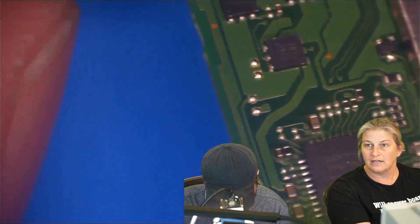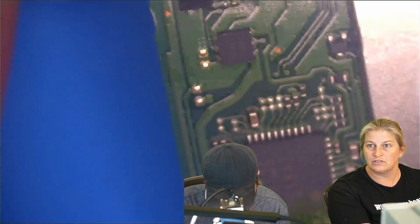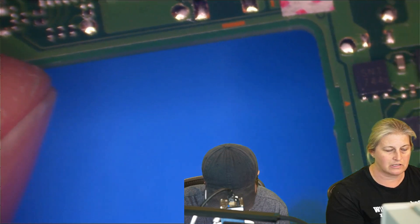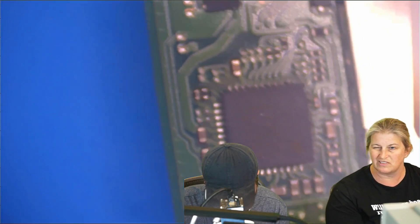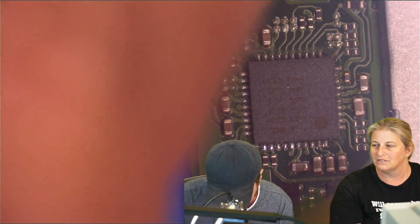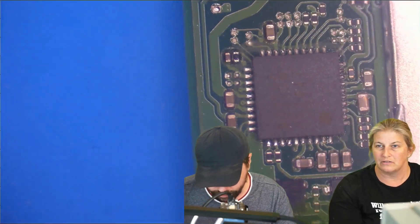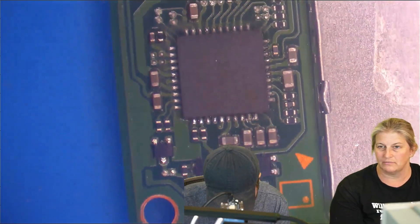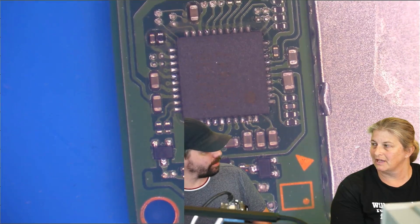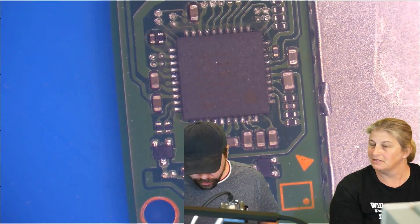I don't see any physical damage. My guess is that a data chip would be most likely to be damaged rather than an actual charging chip. It's hard to damage a physical giant coil. It's easy to damage ones and zeros — delicate handling, thin trace wire, some kind of surge or electrical problem could more likely damage a brain logic chip. I agree — I would go after the one that most resembles TriStar. So that's what we're going to do.